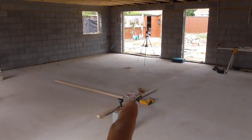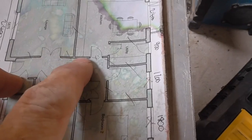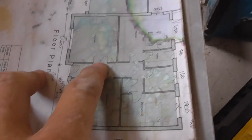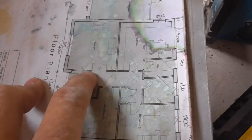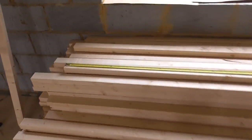You can see I've just got this small section of a wall in here, and basically what that equates to is this small section here. What I'm coming to next is this doorway. I've checked with my scale rule and it looks like this is a pair of two-foot-three doors, so I'm going to mark this opening on the floor first. I'll get the exact size and quickly show you how I've done that — using a bit of stud as a marking-out rod.